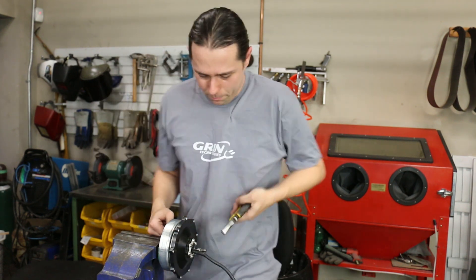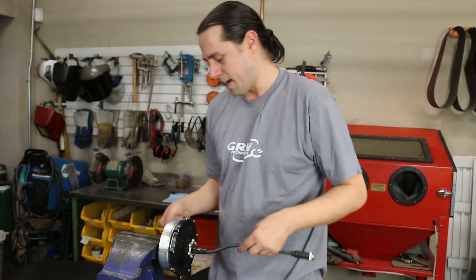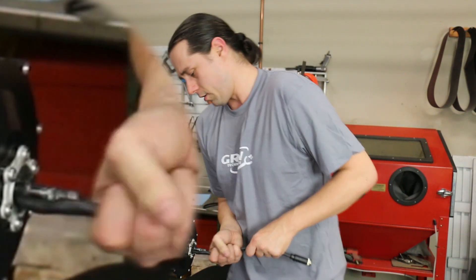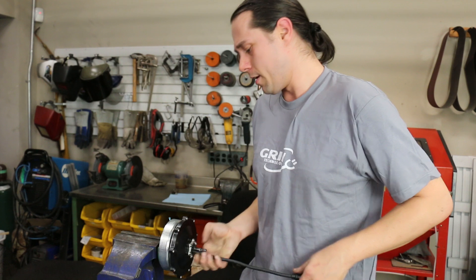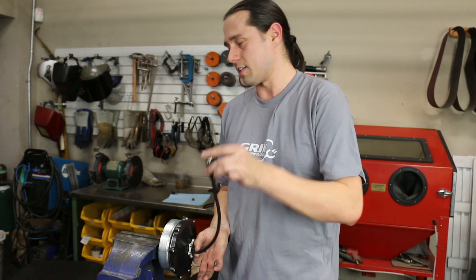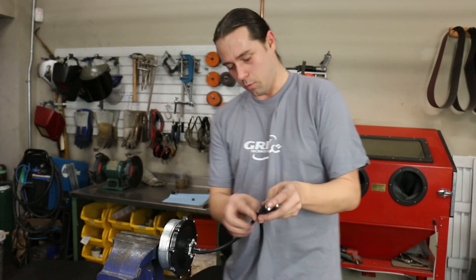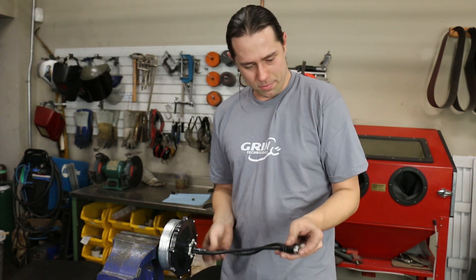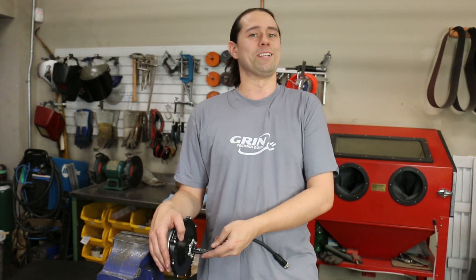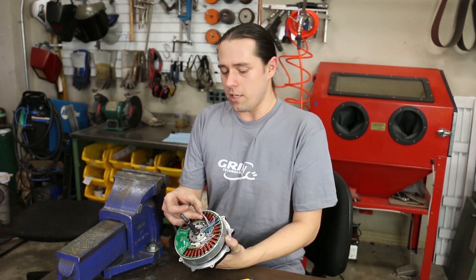This is actually a perfect example of what happens when you pull on the conductor: now that I've lost the outer jacket, as I pull on the inner conductor the outer jacket outside the motor just bunches up in compression and we almost certainly won't be able to get it much farther. This can be a problem if you need a very precise length of cable running outside the motor case. We're about six or seven centimeters longer than before, so we'll do our joinery and roll with a little bit of extra slack.